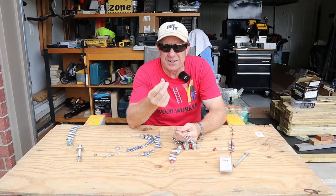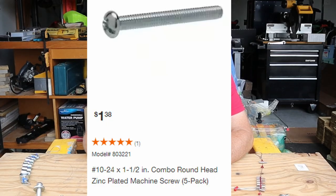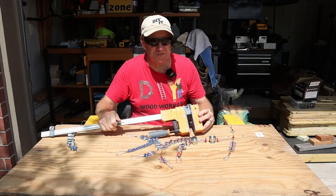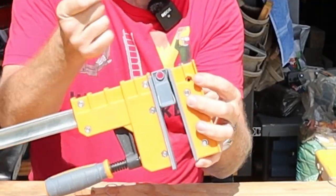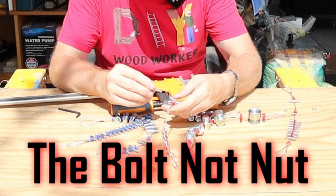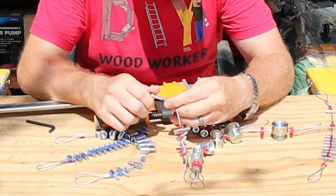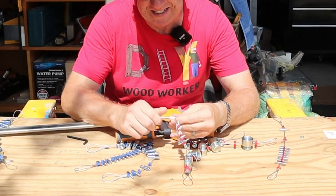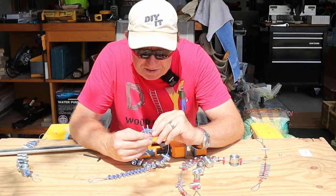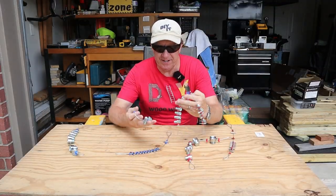Basically, what you can do is say you need a dozen of these — you've just determined it's a 10-24. Go online or check your local home center for those 10-24 screws. Another nice feature: say I've got this clamp and I'm missing the nut. Easy — just take the nut, hunt for the size. That hit on the quarter by 20 but doesn't thread well, so let's check the metric side. We have a winner — that size happens to be a 6 by 1. Go online, they've got a bolt for it. There you have the thread identifier.